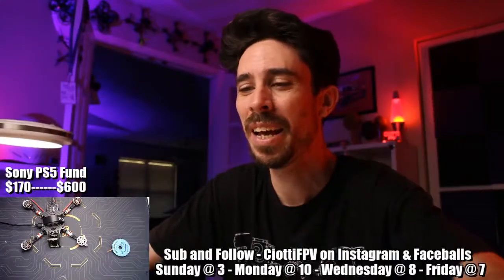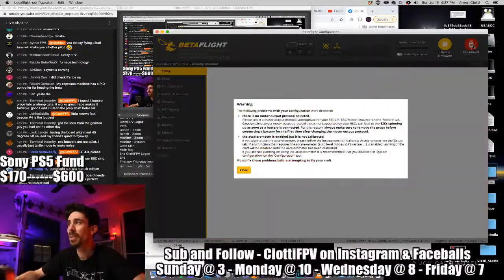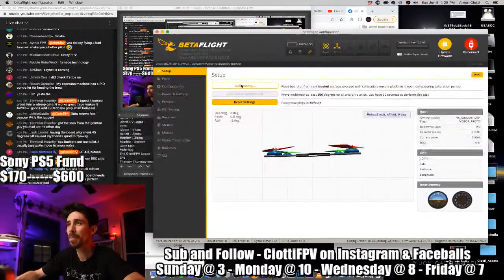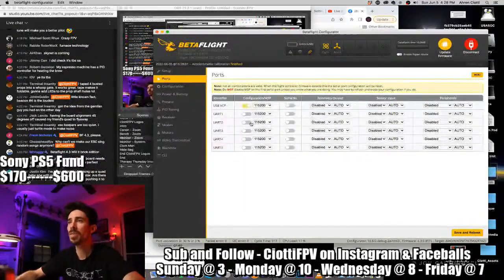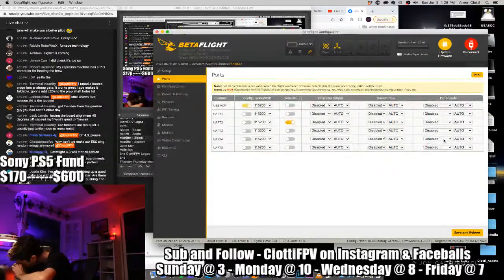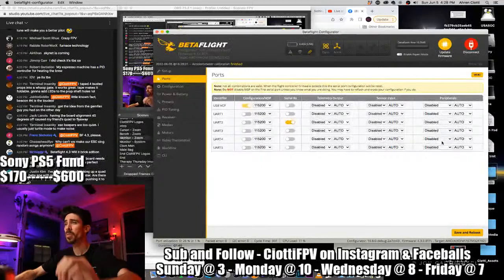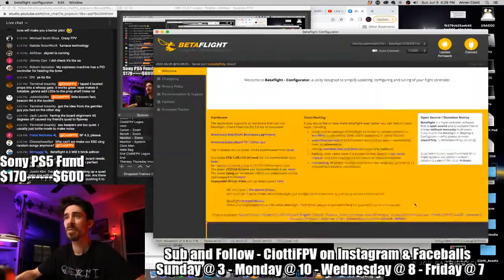Apply custom defaults, and all right, now we're gonna redo all that. There we go. All right, cool. Calibrate accelerometer. Cool, good to go. Ports, UART 2 serial, UART 4, was it 4 or was it 3? It is 3. UART 3 is smart audio, and I'll get it onto the TBS one this time. Save and reboot.